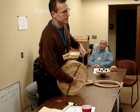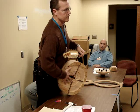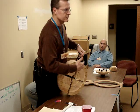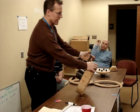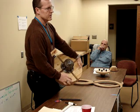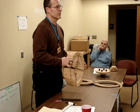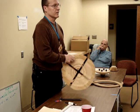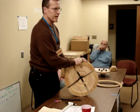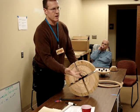The reason you made it so big and thick is so you can change it — keep cutting it. It's not a fixed design. Every different piece I might need to cut another notch. I can turn it flat again, and these jaws just come with the chuck — they're reversing jaws. You make your edges, make the rings. This is so handy because you can finish a piece, put a shop towel here so you don't mark it, just clamp down until it's snug, and you have full access to the bottom. Then I pop it out and it's done.